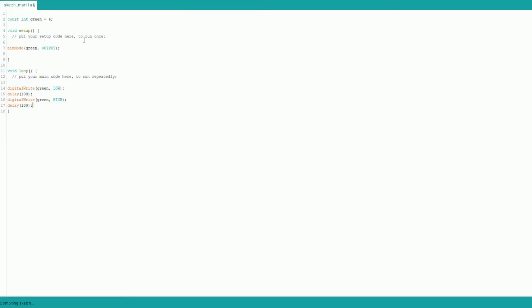Actually, you know what? We forgot to do something. If you make code and you want other people to use it, a very important thing is to do //, and then type and tell people exactly what that does. Because if you have to work with somebody else's code, it's a massive pain. So const int sets green as a global static variable, I think, and sets it to pin 6 on the Arduino. So there you go.